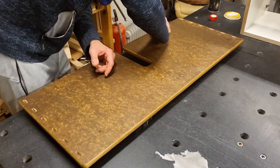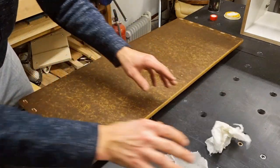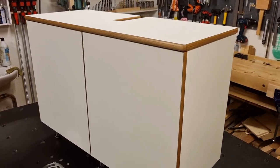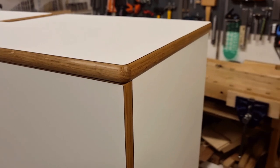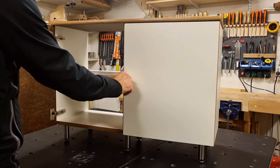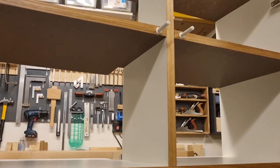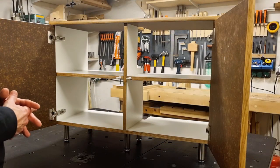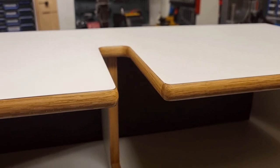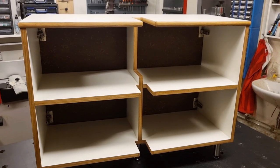You can see some domino holes here as well — those are for later mounting of the tabletop onto the cabinet, not covered in this video. The top is finished and complete, and mounted onto the rest of the cabinet it looks like this. The finish on the top looks quite good, slightly protruding on all sides to cover the doors. Inside, I put a push-to-open mechanism in the center shelf for a clean solution to open the doors. Everything is laminated on both front and back sides with edge bandings in solid oak. The cutout on the backside is for the drain from the bathroom sink.